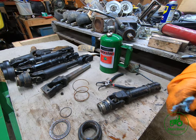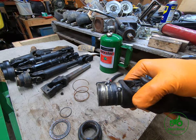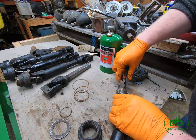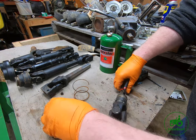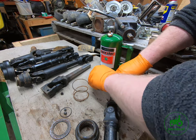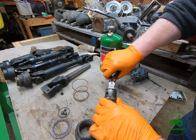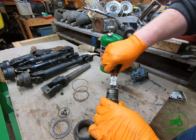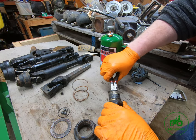What we need to do is take all of these ball bearings out, because they just get all kinds of crap behind them over time. To do that you take the same pair of snap ring pliers, put them in there, and pop them out into a little retaining area. Note that the two ball bearings on the main part of the collar are larger than the other four.